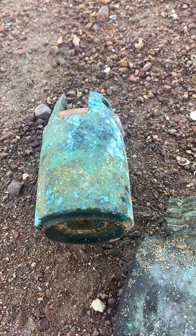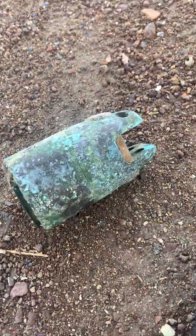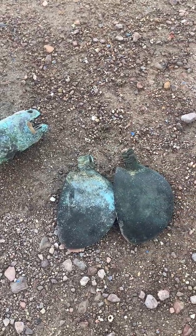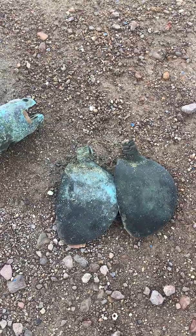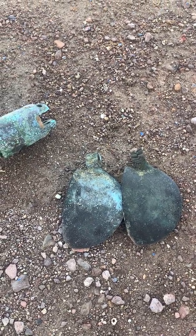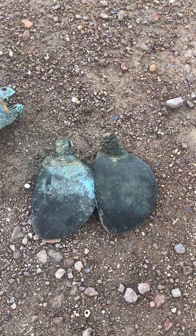That prop, before it corroded like that, was actually functioning just fine — it was a very, very decent prop. I was getting 7.2 knots at 2200 RPM with my Volvo 55 horsepower, pushing a 40-foot Bavaria 40. That prop works really, really well. It's a two-bladed model.